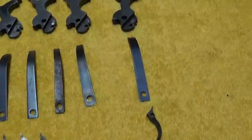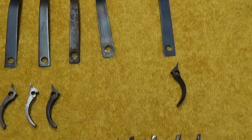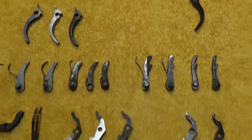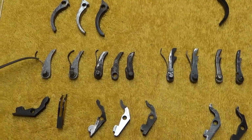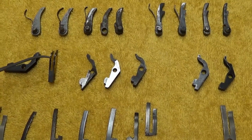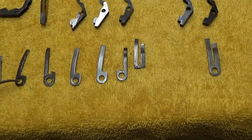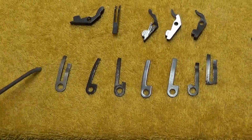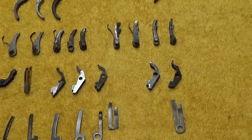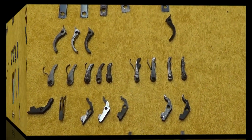I'll start here by hanging some names on these things. The top ones, of course, are hammers, followed down here by our mainsprings, and then we've got our triggers with the tip up here known as the sear. Got our hands and a handspring attached, and then we've got our bolts, and these actually have two springs, a left and a right arm, you might say. And finally down here we got our bolt spring on the right hand side of this one, and the one that puts pressure on the trigger on this side over here. So those are the basic 6 parts we got in here, and those are the names that are pretty much standard for these 6 parts.